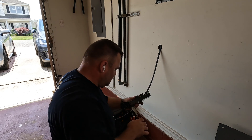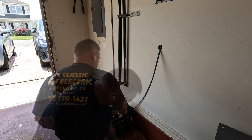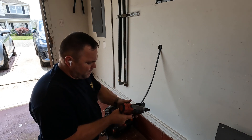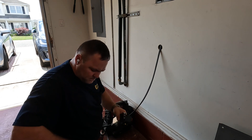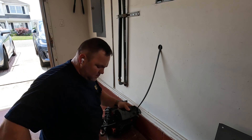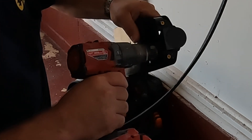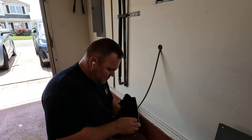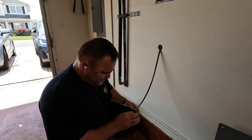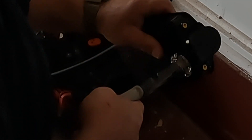In a minute I'll be using a step bit to knock out the plastic knockout so I can put my Romex connector in. If you haven't seen a step bit, you'll see it here in a second. You can get variable hole sizes using a step bit — they're a little expensive but definitely worth it. I go through a couple every year. We're going to ream it out until we get the right size, then I'll use my lineman pliers after the lock nut is tight to tighten it even more, making a firm connection, then bring the wire through the connector and mark my anchor holes on the wall.